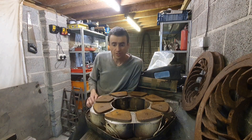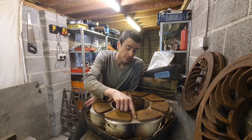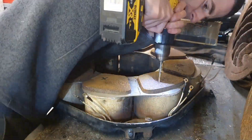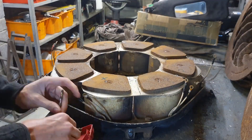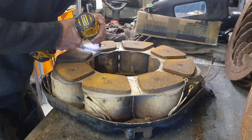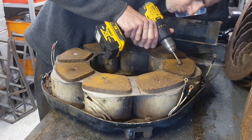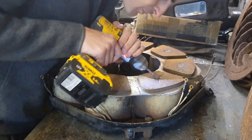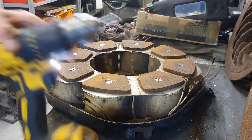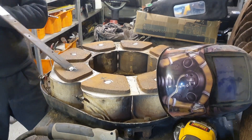I've disconnected all of the coils and tested them all for continuity — they all have continuity. I've also tested them for continuity against the body, and that's where the bad news starts. I'm going to have to take it apart, and because this huge stainless steel plate is here I'm going to have to take every single one of these caps off. I'll drill out where they've hammered the material into the screw end to stop it coming out, then use my welder to get all these screws out, remove these plates — or shoes I think they're called — and then the covering plate, so I can see what's left, how much good insulation there is.